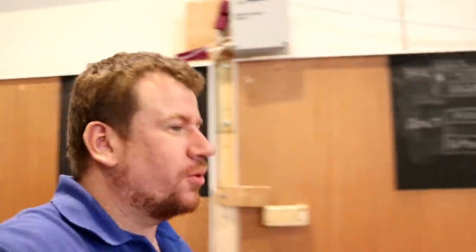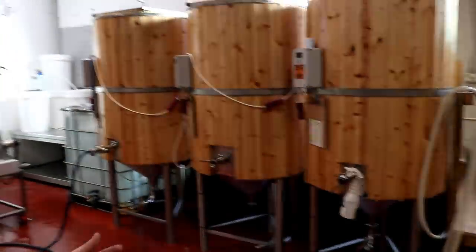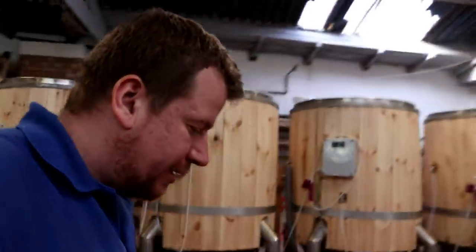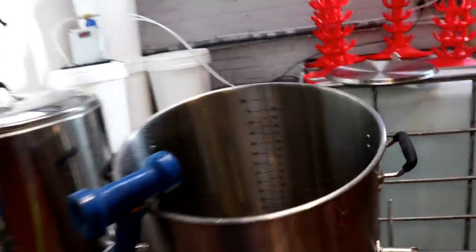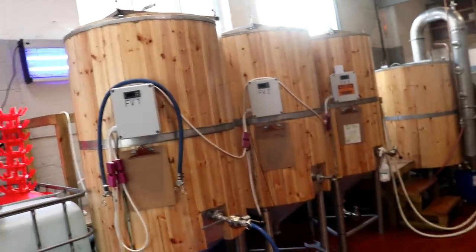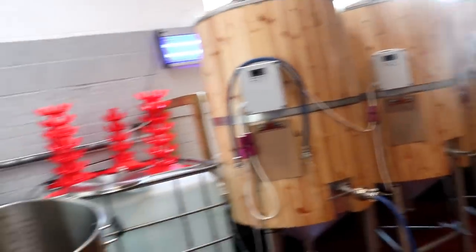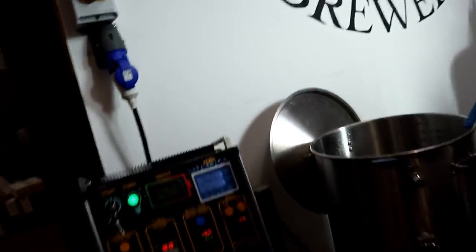What an absolute radical day we've had today - we've got everything done as I wanted and we've still got 10 minutes to spare before we go home. Gemma's just doing the bottom of the tanks - these were full of beer from casking the other day. This is the rinsed water from the boil kettle and it's just about to empty. We're transferring all 40 litres of caustic out of the HLT and putting it into FV1 to use it to clean these three fermenters. The caustic is basically brand new - there wasn't a lot to clean.